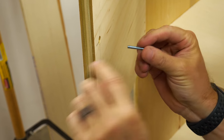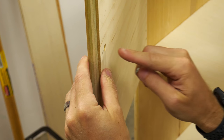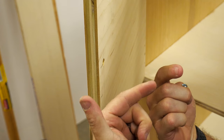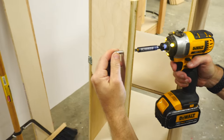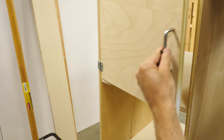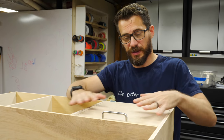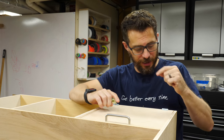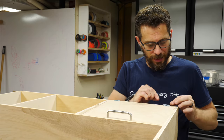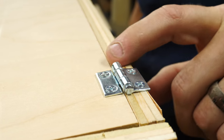I've got these holes for the hardware and made sure to countersink them on the back side so that the head of the screw can go all the way in. There's going to be a mirror on this face, so we don't want anything sticking out. I also realized I want an edge band on the front face. I'm going to take this door off, and in that process we can fix these hinges — I put the barrel of the hinge outside the door, but it can just as easily lay on top of the door and get rid of this overhang on the outside edge.